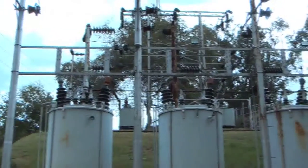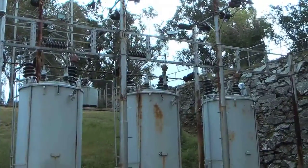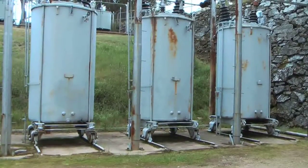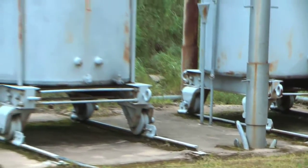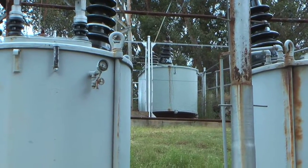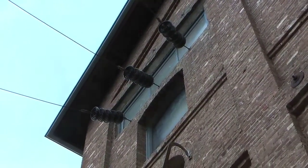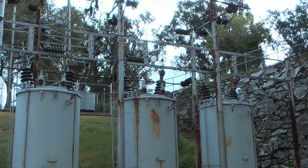Right in front of us are four transformers put in around 1920. They're Allis-Chalmers. They're fed from the powerhouse — the windings came in from a 100,000 volt Stockton transmission line and went out above these transformers at 60,000 volts, through the upper story of this building, and down to the Natoma Station powerhouse of the Sacramento Light PG&E substation.